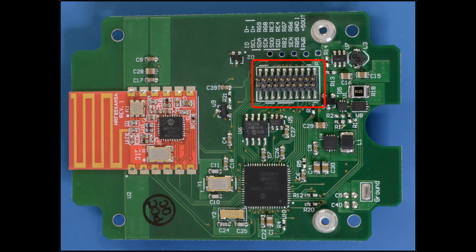Through the use of configurable pins, the user has access to USB, I2C, SPI, UART, pulse width modulation, timers, counters, LIN, infrared communications, RS-485, and analog to digital converters. The 20-pin 1.27 millimeter micro header allows for connecting to your own custom hardware.